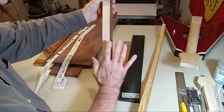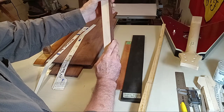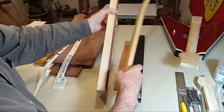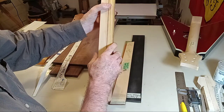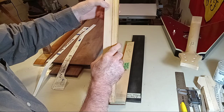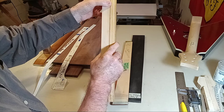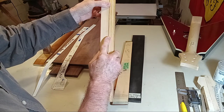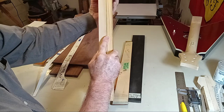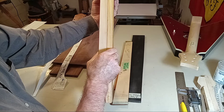and you wanted to do some accent pinstriping between that, then yeah, that's cool. You can do that, and it's tasteful. It actually does look really good. But if you're doing a maple, make certain that your pinstripe is either a walnut, which would be very dark, very black, or is a mahogany. And once you glue that up, it would have to be very, very straight, very clean, and very precise.